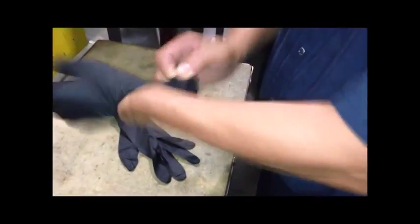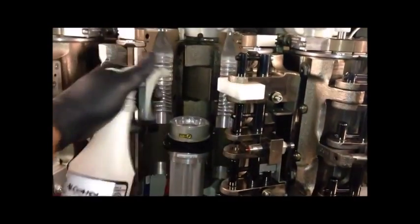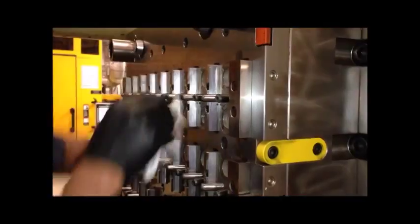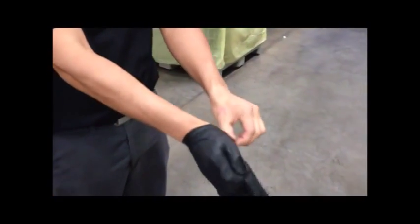Rubber gloves are to be used when cleaning various machine parts with chemicals such as orange cleaner and alcohol. You may use these gloves to clean labeler drums, blow molds, or husky molds, just to name a few. Rubber cleaning gloves should be changed and discarded as needed or prior to performing a new cleaning task, as contamination and pinholes can be difficult to detect.